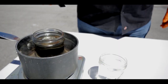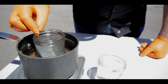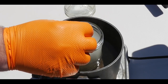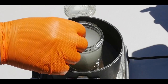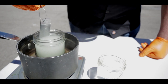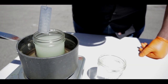It's time to go ahead and etch the sample. Our acid is ready, we have our neutralizer ready. We're going to go ahead and go into the hot acid and I'm going to start watching the bubbles. The bubbles are going to start forming rather quickly and I'm going to tap it on the side of the glass to release some of those bubbles to make sure they're not sticking to the sample — if they do, it may affect the etch in that spot. Periodically I'm going to pull it out and look at it to see where we're at. It's starting to give us our pattern. Because I'm using hot acid, this is going to happen a lot faster than room temperature acid — it's exactly why I like to do it this way. It's already looking good. I think that looks pretty good.